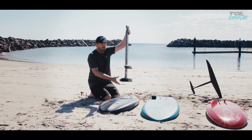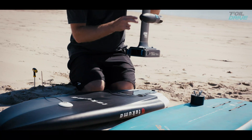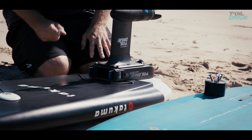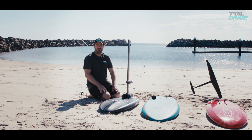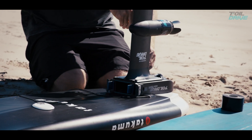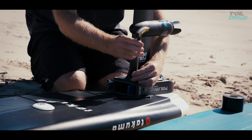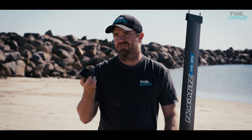To install it, get your Gen 2 and put it on top, making sure to put it to the side of the piece. There's a little black piece at the back which stops the unit from going too far back, but effectively the patch antenna is the same shape as the box — you just want the two to match up and the bolt holes to align, then put your bolts in and do it up like you normally would. I've got my four bolts in now — I've actually still got quite a bit of thread there, so I don't need longer bolts on this particular board, though that also has to do with the base plate having nice deep grooves for the bolt head. Check your bolt length and make sure you've got the appropriate one.